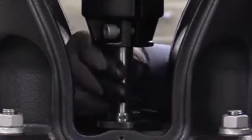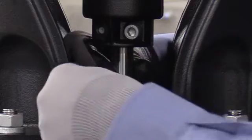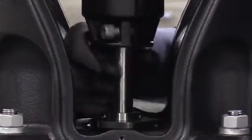Now, very important: failure to properly torque the screws can cause the screws to back out and cause seal leak and shaft damage.